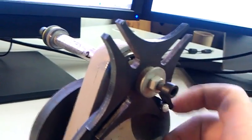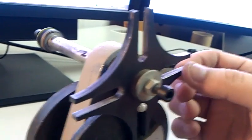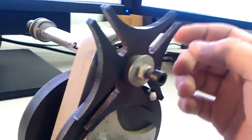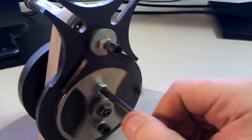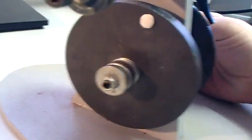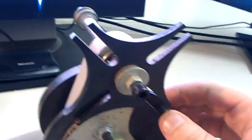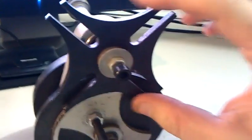Enter the elegant solution: a gear. Not any gear — this one has a special design which converts the motor's constant, always-turning motion into a motion that happens rarely and intermittently, hence the name Geneva Intermittent Sprocket. And here's the model. I'm going to turn this model by hand, and you can see the white dot that I put on the flywheel, just for the purposes of the demonstration. I turn the wheel constantly, it turns constantly. But on the other side, you see the sprocket — it kind of looks like an old iron cross, but different.